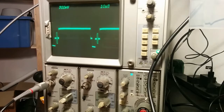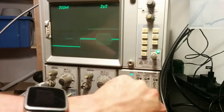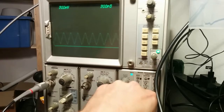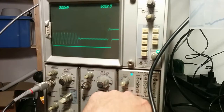Later versions of the Spectrum didn't have these controls, and they had a self-regulating system instead that was better. Right, so I think that's about as good as I'm going to get, given my skill level and what I'm seeing on the oscilloscope. One thing I've noticed is if I zoom in quite a long way, you can see there are actually multiple lines. That's like 500 nanoseconds a segment, so I'm probably seeing individual pixels, if there were any pixels.